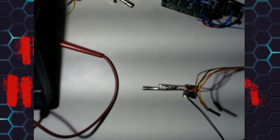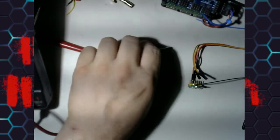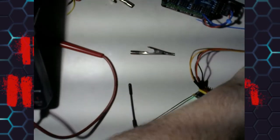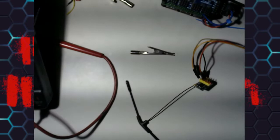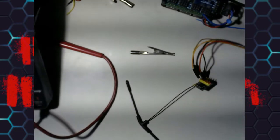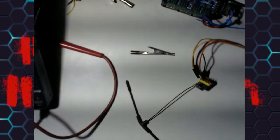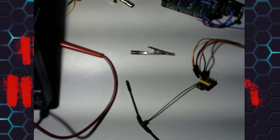Interesting. So I guess the next thing to try to do in this situation is try to see if we can hook it up to a computer and flash it with the newest ExpressLRS. Since it wants to be in boot mode, maybe the software is just corrupted or gone from it from shipping. Got introduced to a static electric charge, who knows. But we'll hook it up to the laptop and we'll try to use ExpressLRS Configurator to flash it over UART, and we'll see what happens.